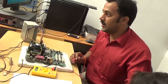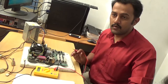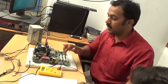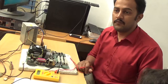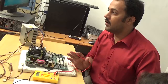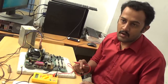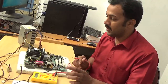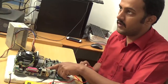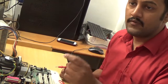The 12 volts track is connected to one coil. This coil's input voltage is 12 volts and the output voltage is also 12 volts, so that's why it is called a 12 volt coil. To identify the 12 volt coil in the processor section, first identify how many coils are available, then compare them — which coil is different in color or size? In this case there are three coils, and one coil is different, so that is the 12 volt coil. Check the coil pins on the back side.